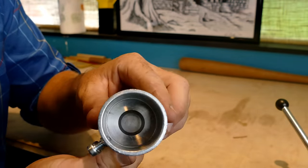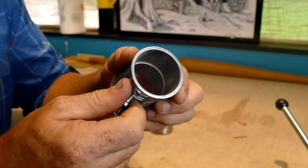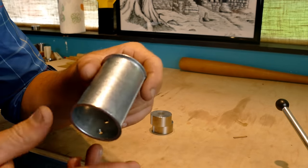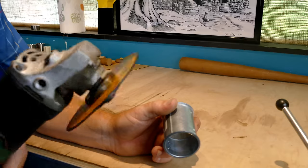But what you need to do right now is cut this thing in half. So the first step, get rid of these screws. Then we'll mark this thing out and then cut it. You can use a hacksaw but I have the benefit of a grinder, so I'm going to be using the grinder.